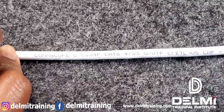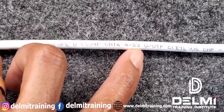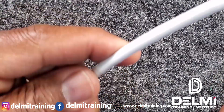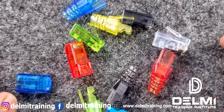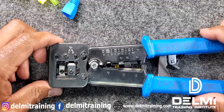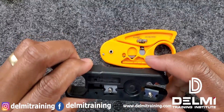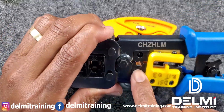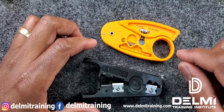To get started we're going to need a piece of cable. This is a category 6 cable — it's an unshielded twisted pair, so it's a UTP. This is going to be our test cable. We're going to put RJ45 Cat 6 crimps on it. You're going to need your crimp tool, and you're going to need a cable stripper. I also have another cable stripper, and I always prefer to use a dedicated cable stripper over the one that comes with your crimp tool. I'm going to show you how to use them — they both work pretty much the same.